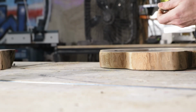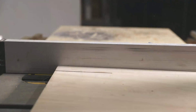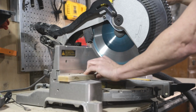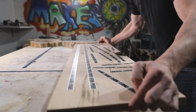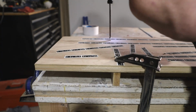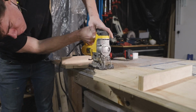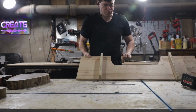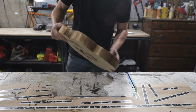So I had to make a really simple three-part jig for the Origin in order for it to work on the slab, and let me explain why I had to do that. The Origin gets its bearings while it's cutting using a camera to see a special tape with markers that kind of look like dominoes that are called fiducials that surround the workpiece. Since the tape has to all be in the same plane and the camera looks outward in front of the cutting bit, you usually have a piece that's the same height as the workpiece surrounding it with the tape.